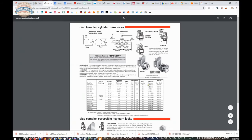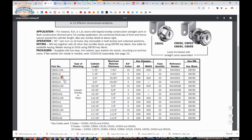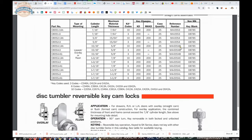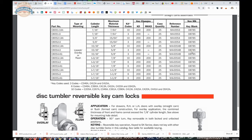There's also a link below this video to a document called the product brochure. We're looking at the 8052 lock in a 14A finish, not in a 3 finish which would be brass. Cylinder length is five-eighths, max material thickness is 15/64ths. Down below they also talk about different key codes that can be done — all sorts of codes, meaning just the bitting, the code of the key which relates to the cuts. C346 means a particular bitting or cut on the key blank itself. The key blank number is D8785 — you can order those blanks separately or have the factory cut blanks if you need more than two keys per cylinder.